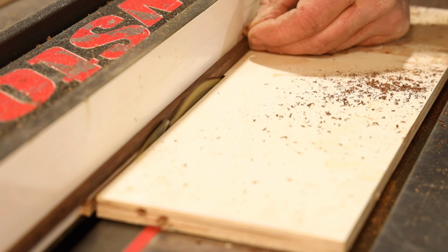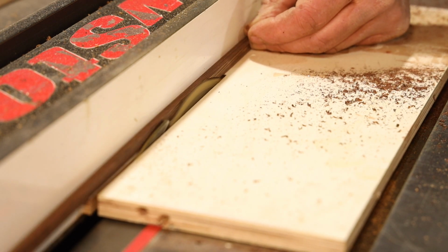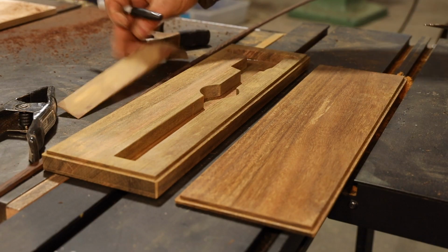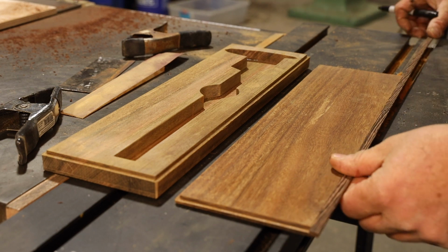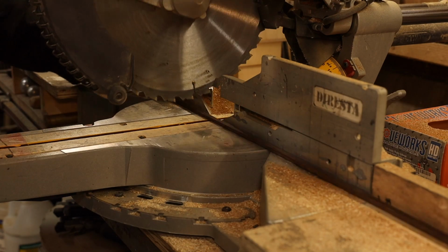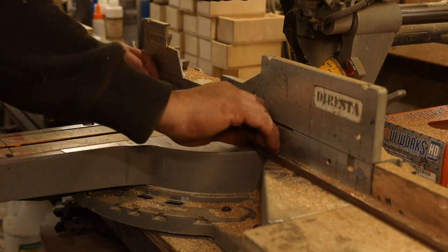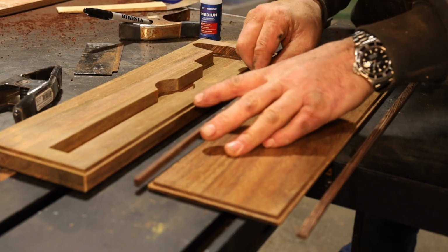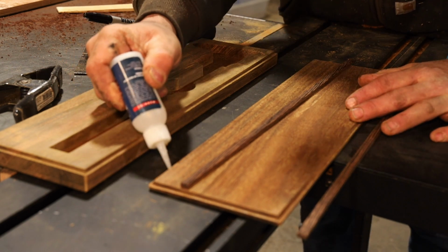And just because it could fall into the cavity behind the blade, I just put a little support plywood. So now I'm cutting that. Just rough cut. I'm making the two long sides long. They're going wider than what I need. I'll sand them into fit. And then the short sides will be trapped in between them.